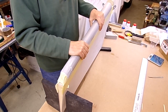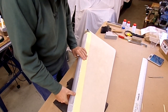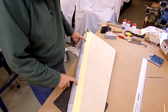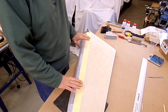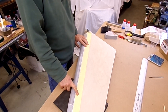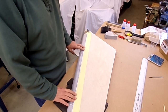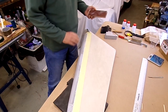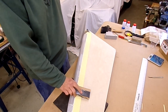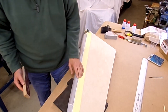I've bonded this on, as you've seen. I'm now just going to sand this down. The tape is here, which I used right up against the joint line, double layer. That is to stop the resin from being on the plywood, which would be number one, but also number two, I can now sand down to that, which will get rid of the excess resin and micro balloon and get this in line that way. And then from there I'll use a long block to sort out the other bits.